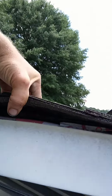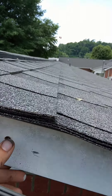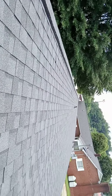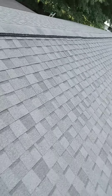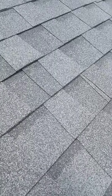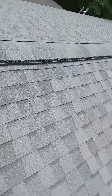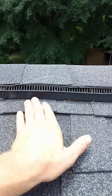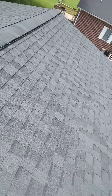The gutters definitely need to be cleaned out, but that's not too big of an issue. Once again, no drip edge — we've got fascia metal with no drip edge. Holes in the fascia metal haven't been sealed. We've got some sagging going on. You can see quite a few areas where it looks as though nail pops are coming through. Every area that a nail seems to be popping up could be an area for concern. We've got quite a few saggy areas.